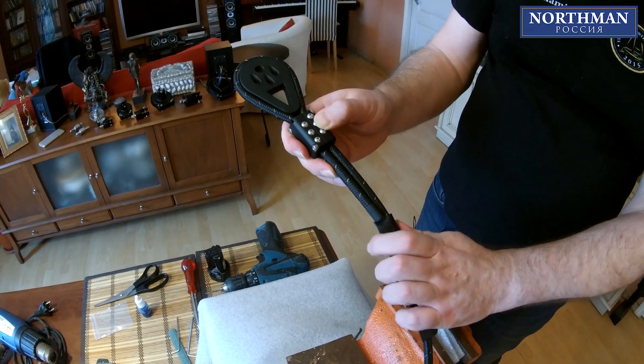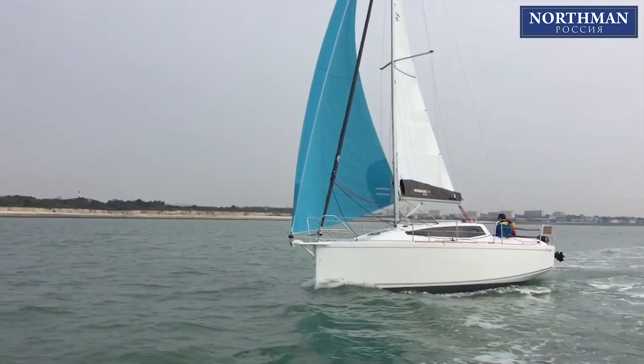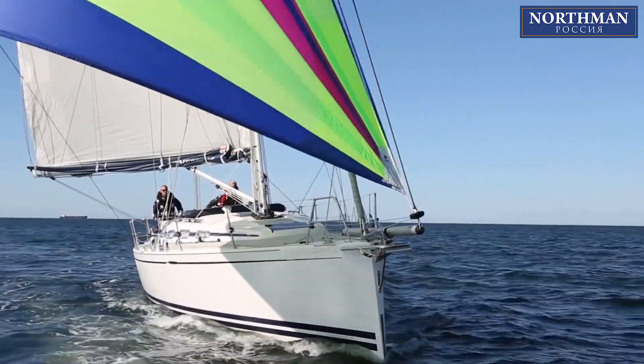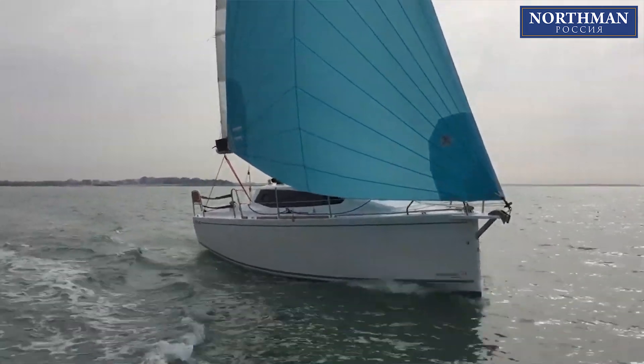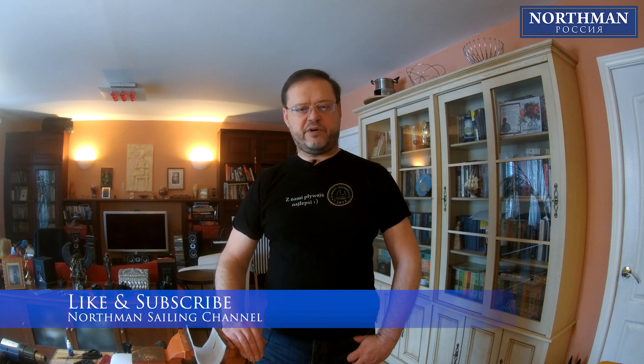For your convenience, we are introducing the Do-It-Yourself NS torque cable kits for various lengths and diameters for different sailboat sizes: 20 to 28 feet, 26 to 38 feet, 36 to 40 feet, and 40 to 45 feet. The NS Alu solid thimbles would fit the NS furlers and any modern furler models with comparatively wide jaw clearance. As for the G30 style furlers, you may use their reinforced thimbles made of stainless steel. Do expand your sailing horizons — choose modern systems for sail handling which are very effective and can facilitate your routine activities on the boat, especially for single-handers. Subscribe to the Northman Sailing Channel, like and comment below, hit the notification bell, and see you next time!